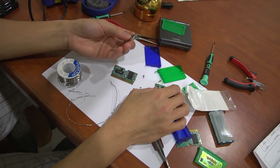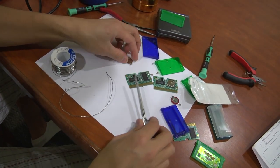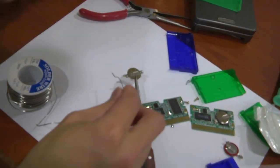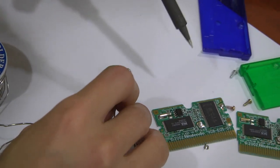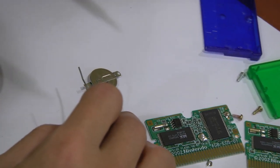Since the battery is fully charged, we have to be careful of not allowing unwanted shorts. Again, first part of soldering: we're going to tin the leads right here. Then, since the other leads are tinned, we just have to heat up both sides and they'll just magically fuse together.